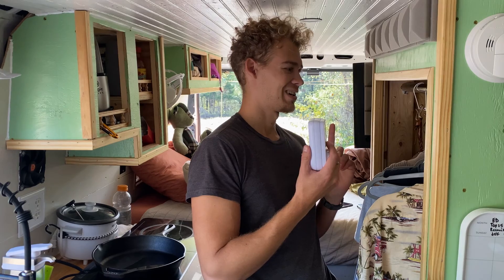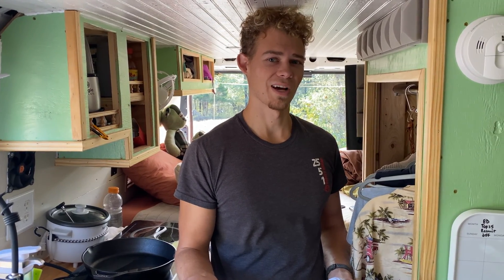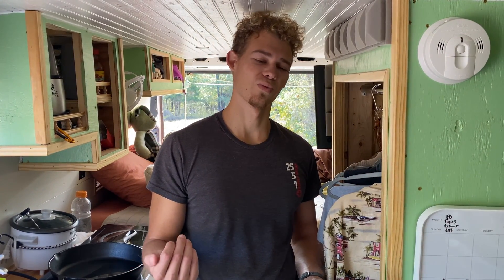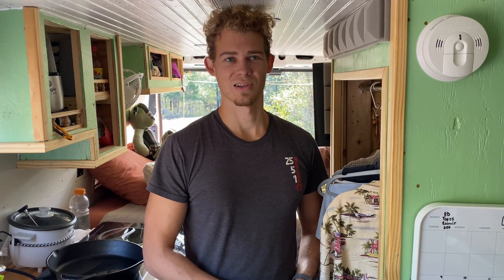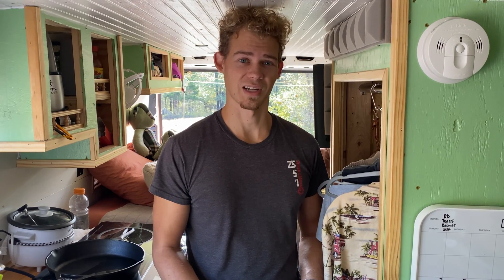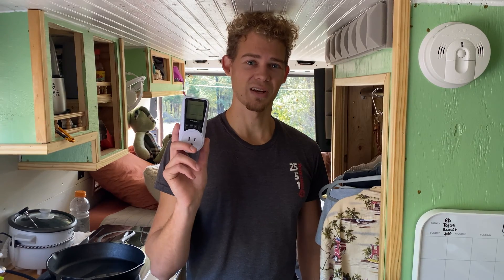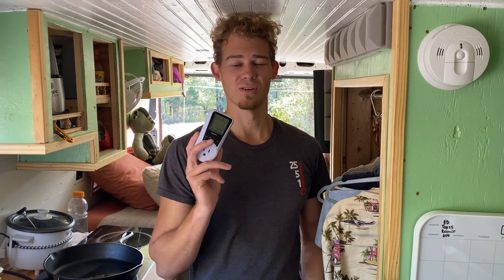The problem was the editing computer — and the video may already be out — but we did have to upgrade our solar and our battery bank because when rendering, this editing computer I built does pull over 300 watts, which is how much solar we had on the top. I'll leave a link to this. If you're thinking about building out a van and don't know exactly how much power your appliances use on average, one of these goes a very, very long way.